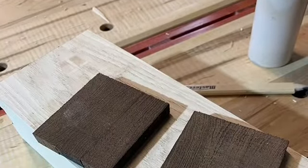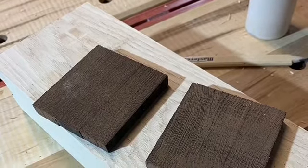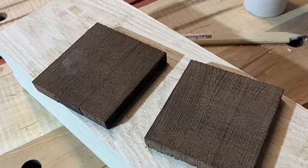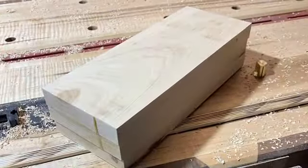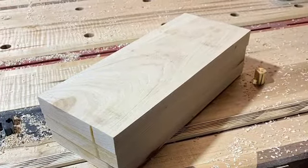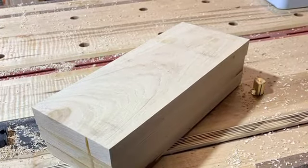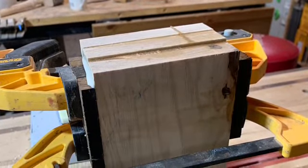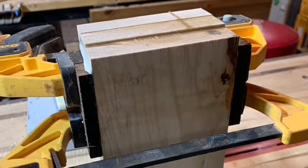The hardwood block you've prepared should start out about three by three inches. You're going to determine the end-grain faces, and off each of those faces you're going to cut a slice about three-quarters of an inch thick. When your block is cured, square it to four and a half inches wide by ten and a half inches long. Then for the last step of your prep, take the two end-grain blocks you made and glue them flush onto the long sides of your block, one inch down from either end.